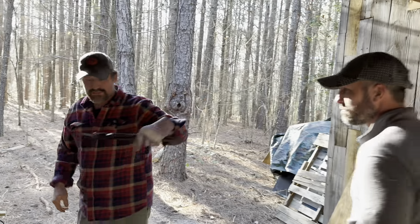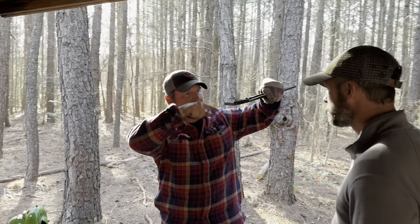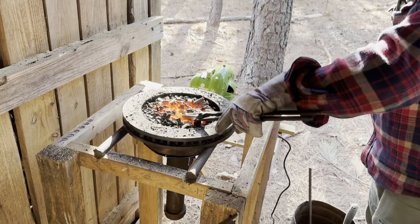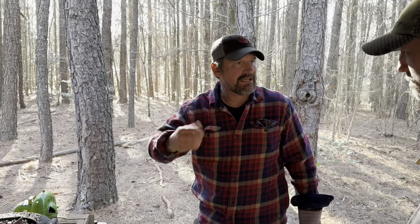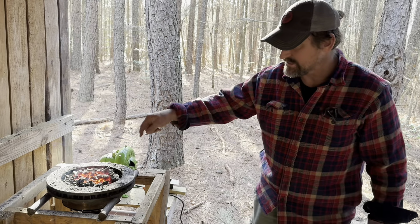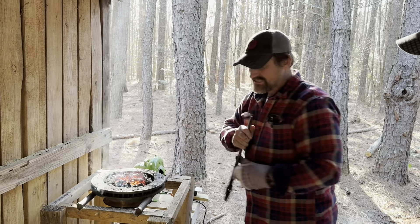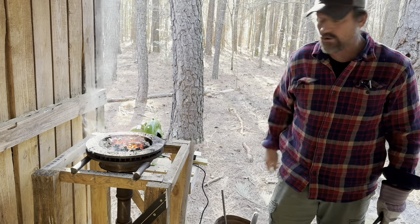You want it relatively straight because you're striking something. Now we're going to take this and put it with the striking side oriented down in the forge - I'm going to set it on top like this because I want to superheat the striking side but not so much the back of it. We turn this on, take it out, and quench that one side hard.